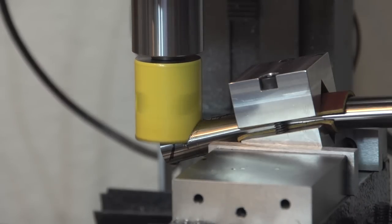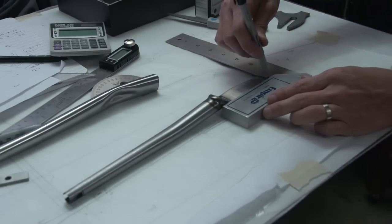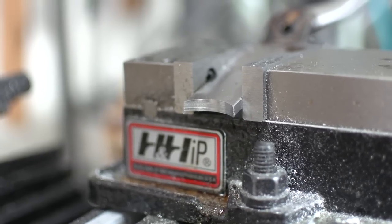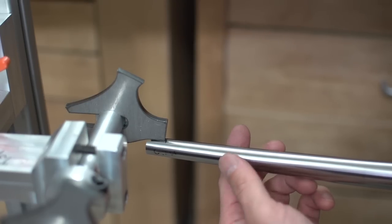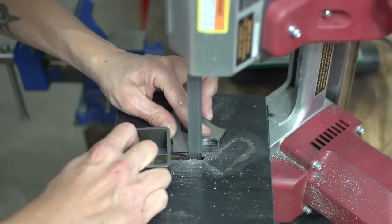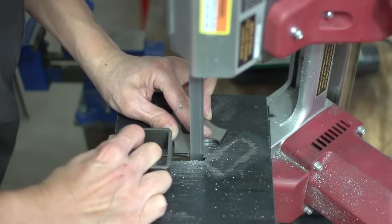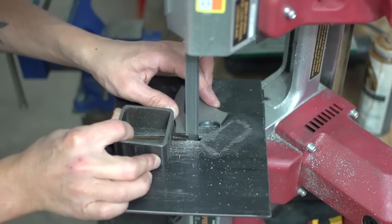And now mitering. For the weird-looking chainstay I decided to try the hole saw on it. I made the cut slowly and it came out great. Checking my cut — it needs to go a bit deeper. However, I messed up here because I need to cut the tab so its orientation is better suited for a negative bottom bracket drop. I should have made this cut a long time ago, maybe at the time I was drawing up the frame plans. Also, the dropout didn't want to cut, but I figured out that the laser-cut edge was harder, so I ground it down and then made my cut on the bandsaw.